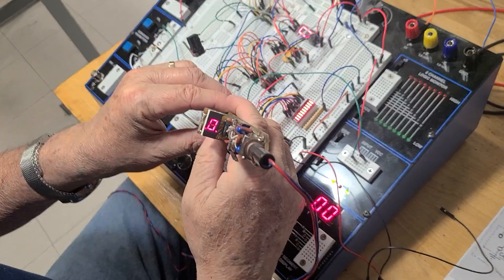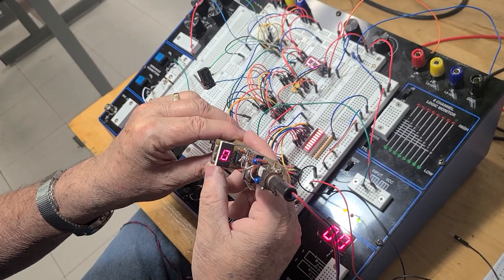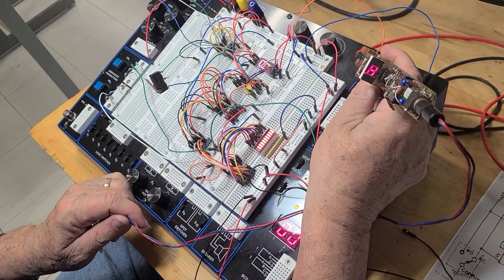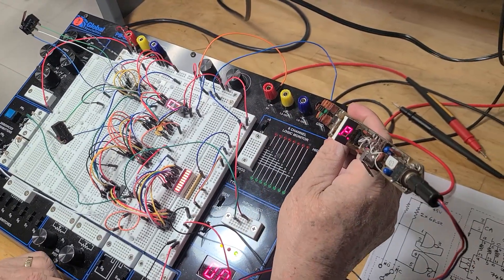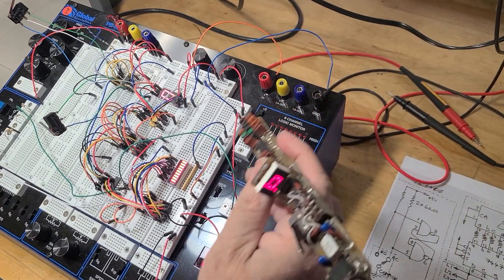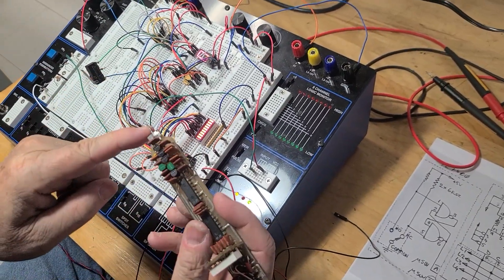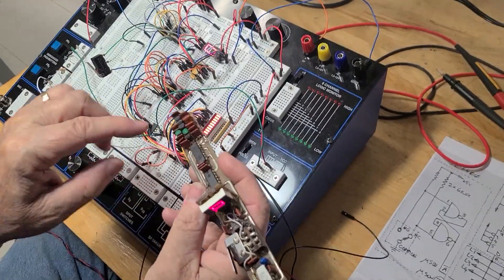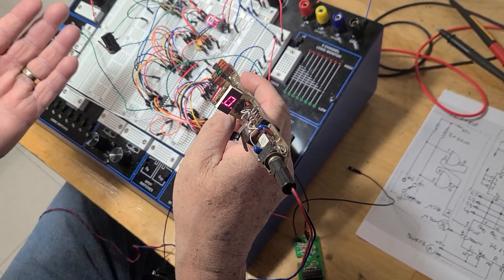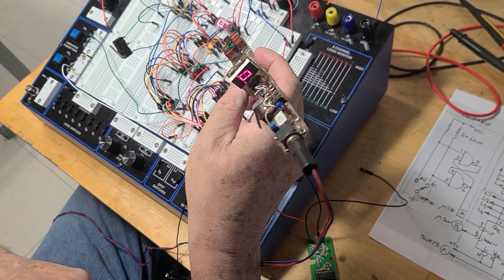The probe can do more — it uses the two decimal points to catch pulses as they arrive. The easiest way to test is by touching the power supply: touching 5 volts gives 'H', touching ground gives 'L'. The probe quickly identifies what's wrong by touching different points in your circuit. The internal circuitry identifies according to industrial standards what is logic zero, logic one, or a limbo state.